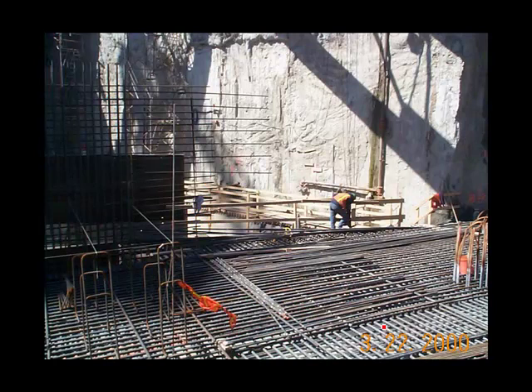This is a shot inside that excavation. Because of the way the sun is falling on the wall, you can see what a slurry wall actually looks like. This is the as-cast appearance — it has a very organic kind of look. It's not what you're used to seeing in a concrete wall, because this wall was not poured against a form; it was poured against the excavated sides of a trench. It's also perfectly dry, though there is some evidence of seepage here, which is a result of cutting a hole through the wall to introduce piping.